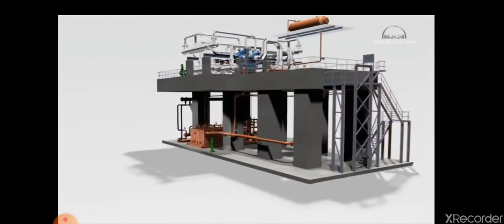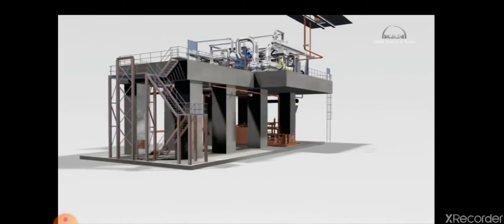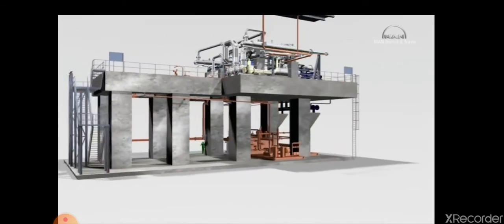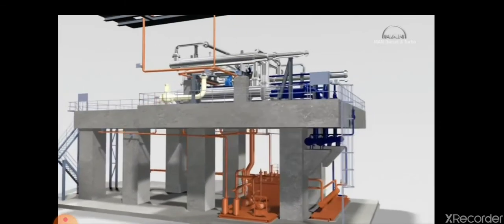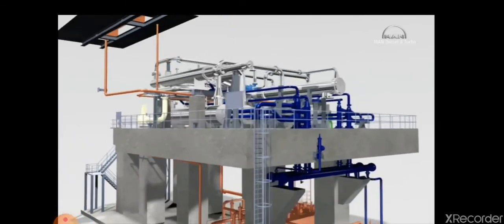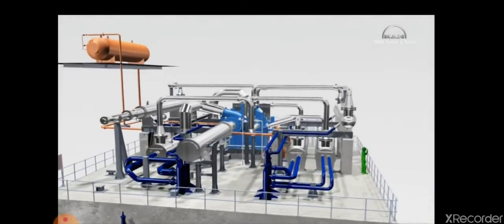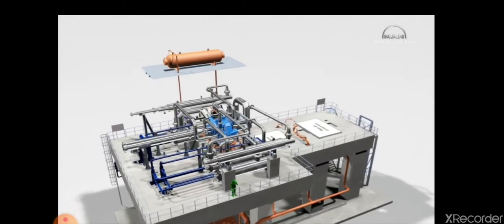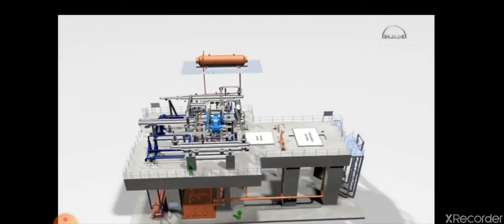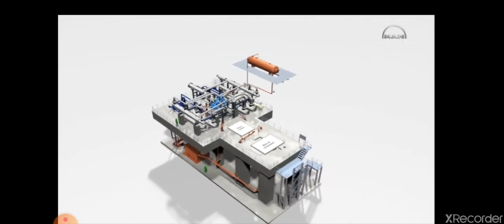The one shown here, driven by a steam turbine and supplied with pre-compressed air by a main air compressor, is used particularly in air separation plants. They generate large volumes of oxygen, for instance for coal to liquid plants. Beside the integrally geared compressor, MAN Diesel and Turbo can supply process piping and process gas coolers, the complete train oil system, or as well the complete machine train from perfectly coordinated components.